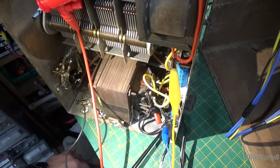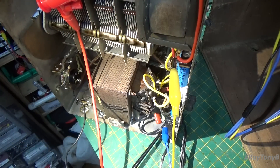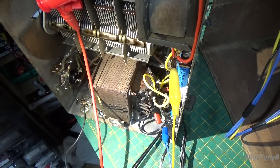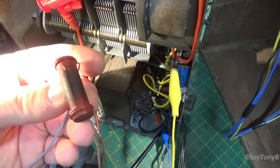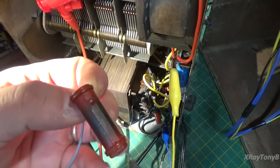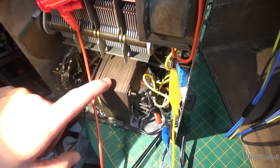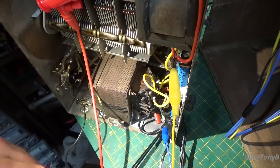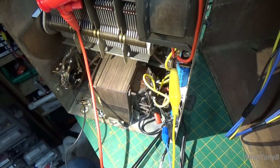I've been saying through every part of this series that this transformer was way too high voltage. After going through the history of all this, I've come to the conclusion that when this was installed, this 3K resistor was put in as a voltage-dropping resistor for this transformer — so it was too high. I ended up replacing it with a 25-watt chassis-mount 4.7K resistor.